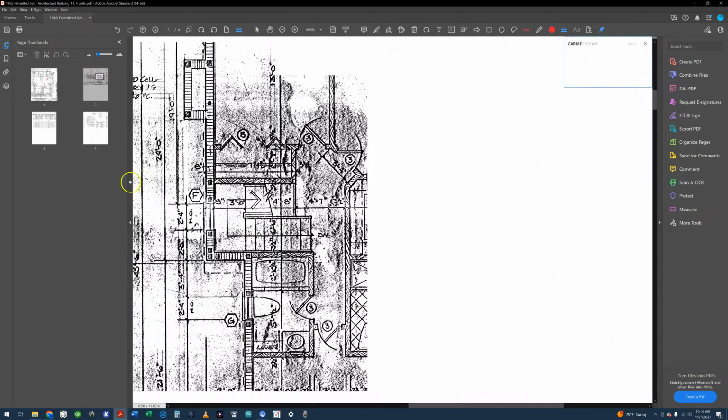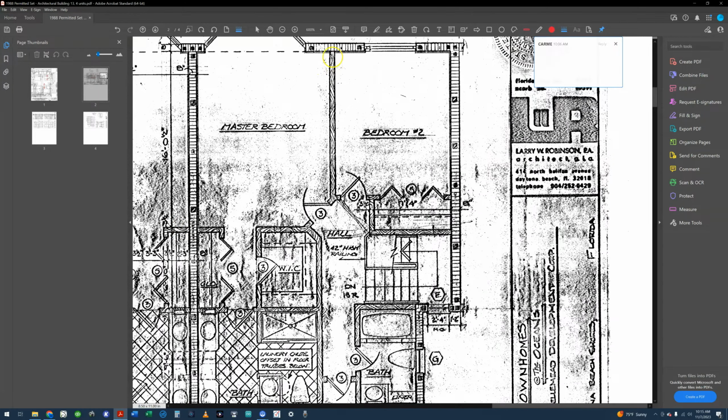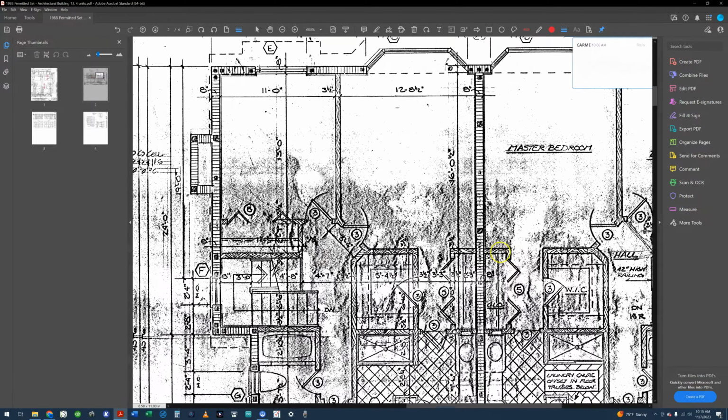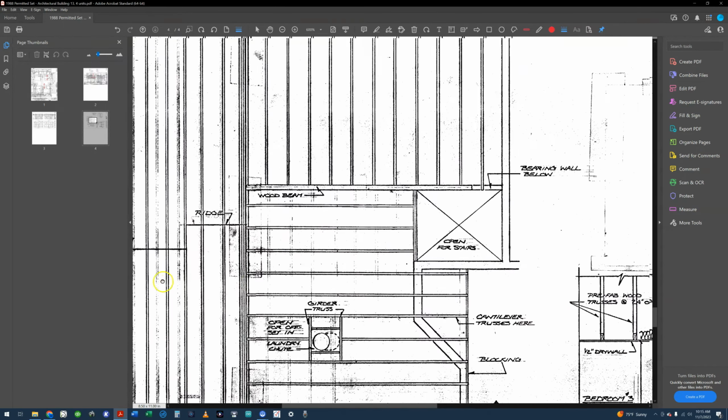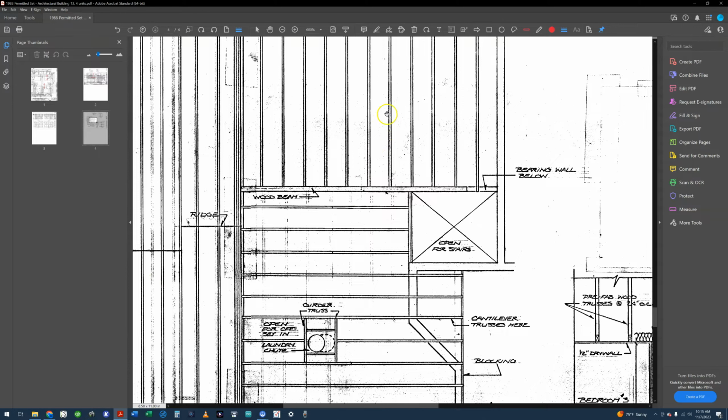The only thing I can think is maybe there's a little bit of sag from this partition pushing down on the floor joist, and this partition also pushing down on the floor joist. Maybe when they framed it out, they didn't run a parallel floor joist underneath the parallel partition. In this area over here, it again shouldn't matter because that partition on the second floor is bearing on these floor joists, and that's plenty of weight to sit on those floor joists. So that shouldn't be an issue either.